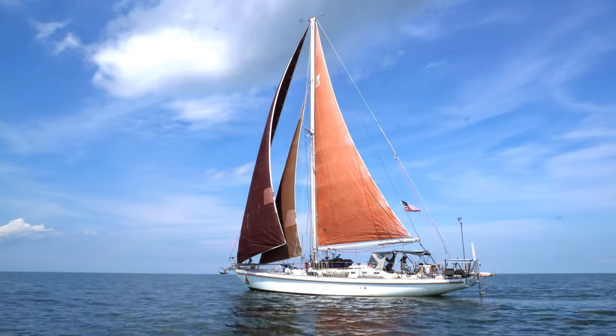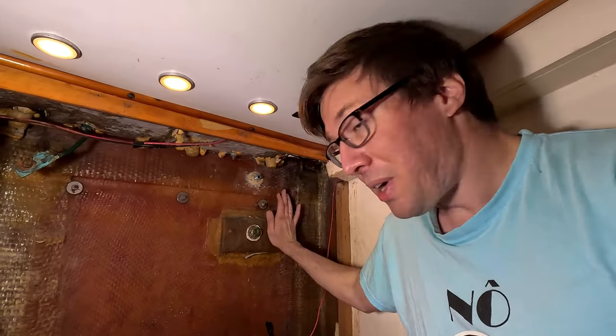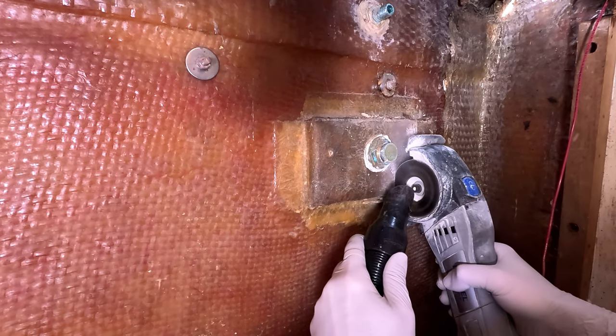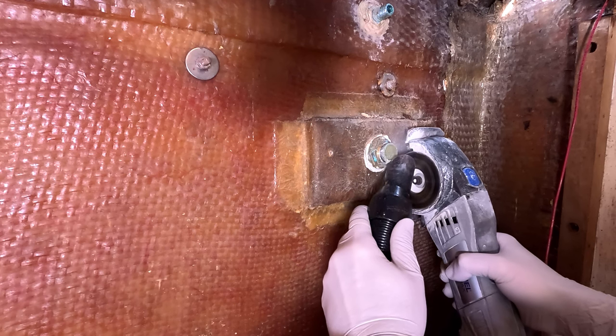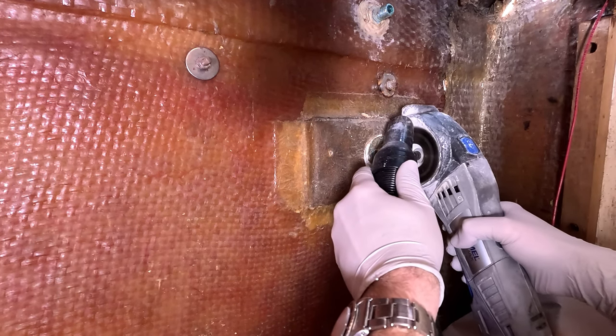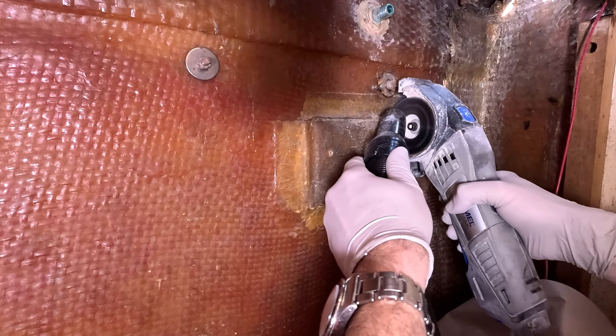I got all the chain plates out of the way — they're no longer up here. We have literally everything stripped out: no plumbing, no wiring, just a nice big open area so we can do our work. The first thing we're going to do is cut this little backing plate off. One of the chain plates is going to run right down this way, which means it needs its backing plate and all its supports in this area. I don't want part of it on the beefed-up section and another part on an unknown block of wood.